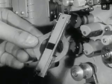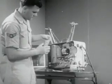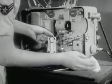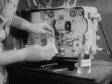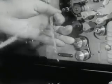While the pressure plate is out, remove and clean the aperture plate. To remove, grasp the thumb handle at the top of the assembly and pull up, then outward. With the aperture brush or moistened soft cloth, remove all traces of dirt and caked emulsion from the entire film contacting surface. Be sure to clean accumulated dirt from the edges of the aperture plate.